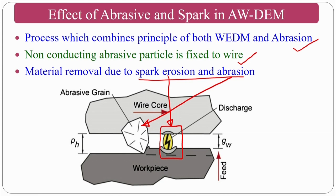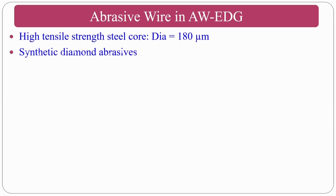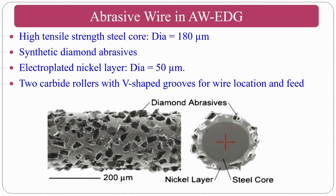That is the beauty of this process — material removal is very high if you increase the current, while normal forces are significantly lower. If you increase current, melting and thermal softening increase; if gap width decreases, the relative portion of abrasion-based material removal increases. MRR is a consequence of increased two-body abrasion when gap is small. At low voltage and discharge current, the process approximates wire sawing, dominated by abrasion action.